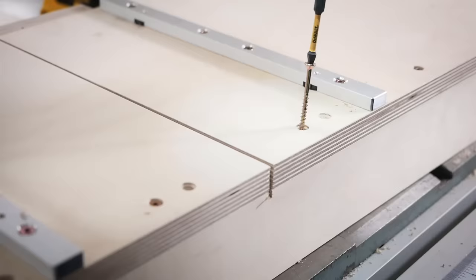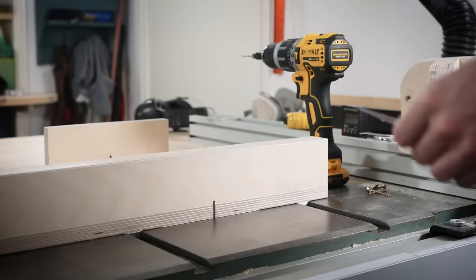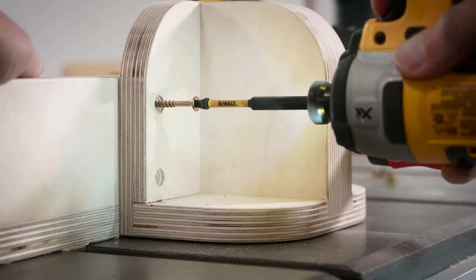The assembled guard is dry now, so it's time to attach it to the back of the fence. I laid a couple of playing cards beneath the guard just to elevate it so it's not dragging on the table saw top. I'm not gluing it just in case I ever need to disassemble it, but I will countersink four screws to secure it well. Remember, this is the piece supporting the two halves of the sled together since there's no forward fence.